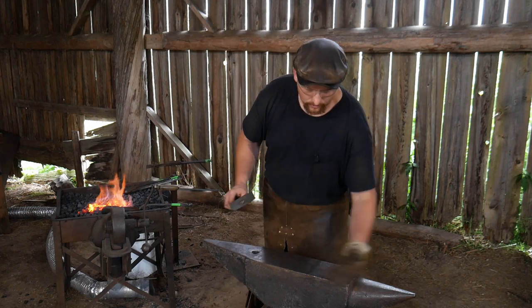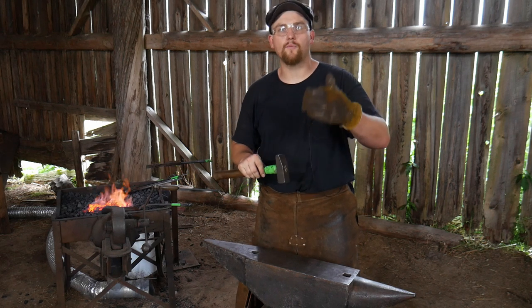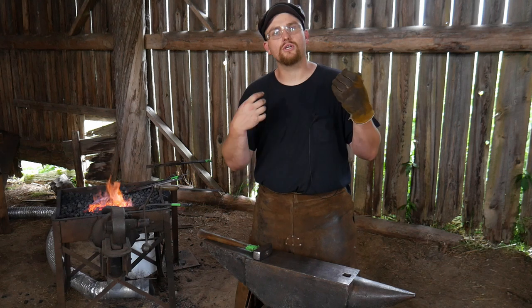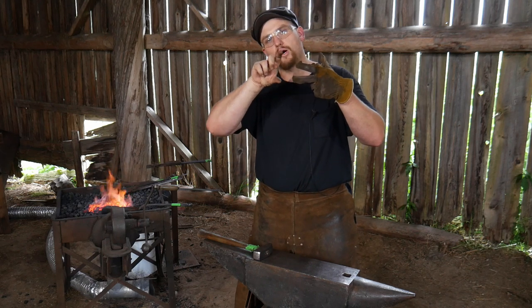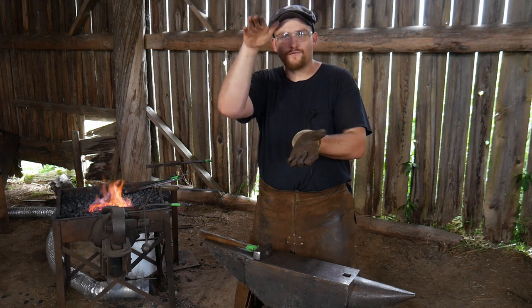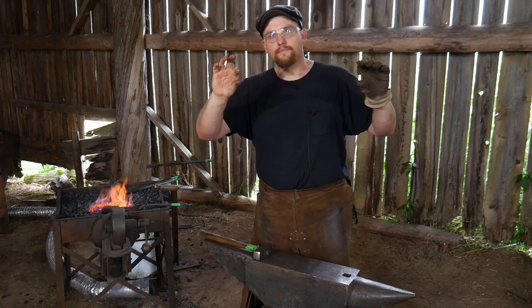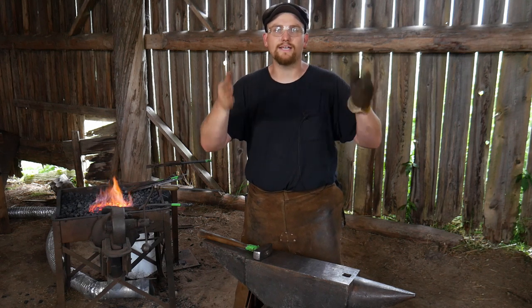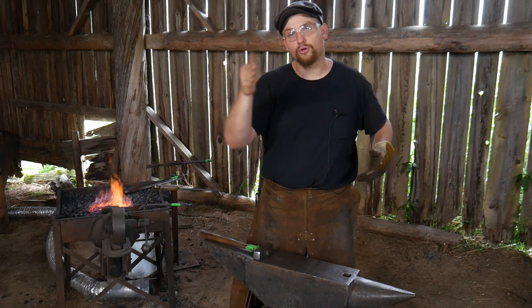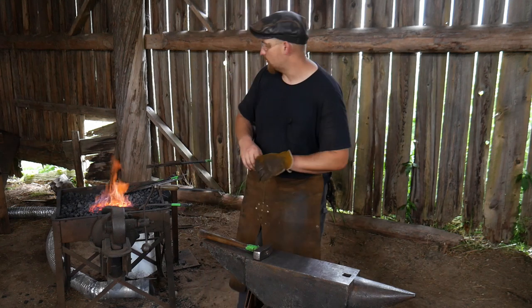It's almost impossible to not get a double bite at some point when doing shouldering work — we're not machines, we're not perfect. That doesn't necessarily ruin the piece, but that's why I start walking in the shoulder rather than starting right at it. Sometimes I'll go straight to a guillotine tool with flat dies and forge that shoulder in nice and tight, close to my punch mark, then work up to those points and finish it off or file it nice and square. That's the benefit of walking onto the shoulder versus starting right at it and drawing away — food for thought.